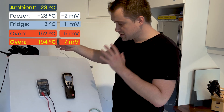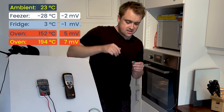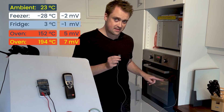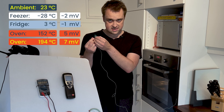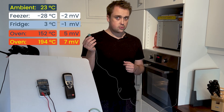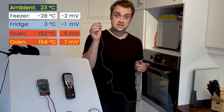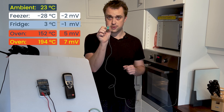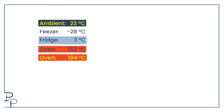The thing you need to understand is that this voltage exists regardless of all of this measurement equipment. There is a voltage because there's a difference in temperature between that end of the couple that's touching and this end — this is typically called the cold junction. The bigger the difference in temperature between the two ends, the greater the potential difference between the two terminals.